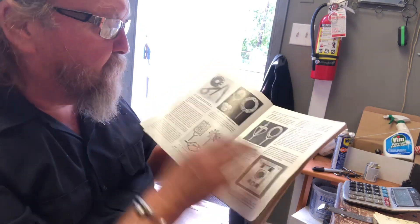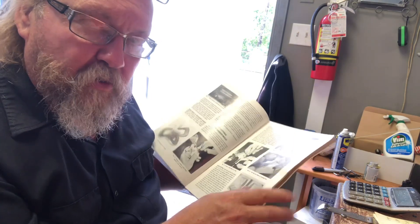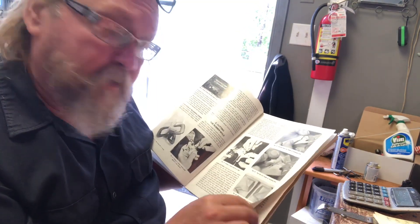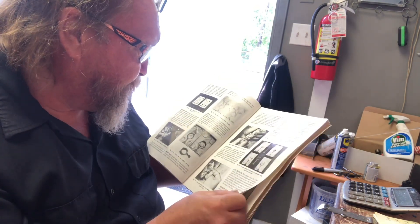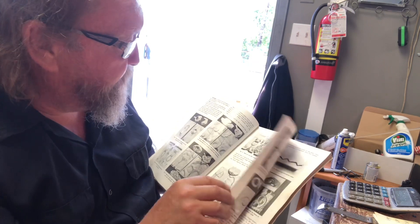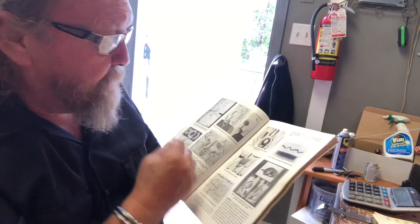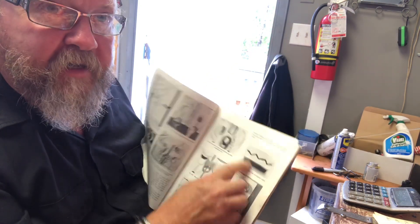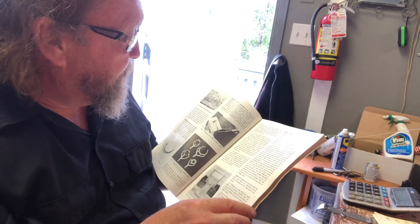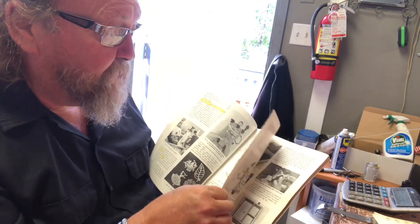It's a great source of information on rubber mold-making knives and jewelry models. I know the products have changed — the shrinkage for vulcanized rubber may have been even more than for silicone. There's neat information on cutouts, cores, and sprues. I do a lot of those core techniques — you pull the core out, cut the wax, and take it off. There are different ideas on cutting the edge of the mold. Then it shows injecting and centrifugal casting the waxes. Great book.